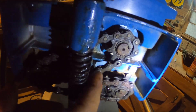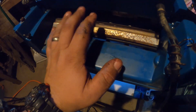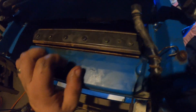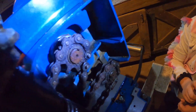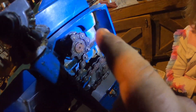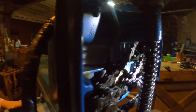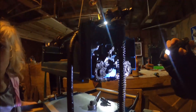As I was dealing with this chain, to get the master link out of the top chain you'll actually have to move the blades — be careful, they are probably sharp. Spin them towards you from back here, out like that. The only spot I could find where you can actually pull that link out is right back in here where the blades come in on the other side, near the blade rollers. That's the only place you should be able to get the link out. Best to use gloves.